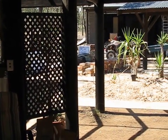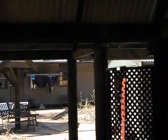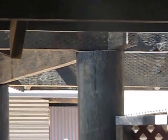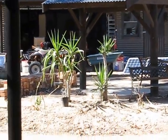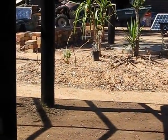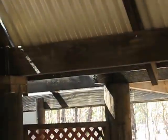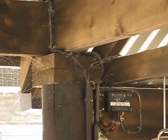So what you have to do is use a little bit of lateral thinking and imagine your poles as just piers. The tops of poles, and I'll show it up there on the tops of these poles, have usually a larger surface area to build the rest of your building off. Roofs, for example, like this one. It has a larger surface area than what you need to sit your timbers on. So you can pick up a lot of the run out that you have in your marked poles on the ground, and when you've concreted them in, you know full well that one pole's 20 mil out of line with another one because of the thickness of it. You can pick that up when you get to the top by just positioning your beams slightly off the center of the pole instead of smack on some mark.